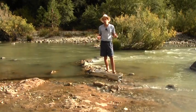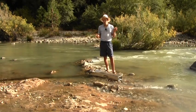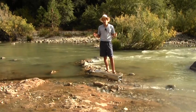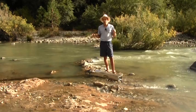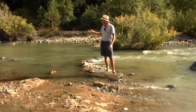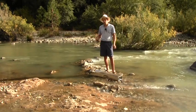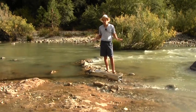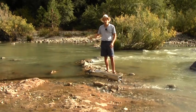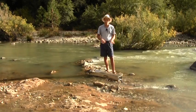The tricky thing about setting up a sluice is getting the angle right. The reason the angle is not just always one number — like four inches for a four-foot sluice — is because sometimes the river is flowing faster than others, and therefore the faster the river flows, the less slope you need. Right now we just had a rain last night, and so we're having a pretty good flow through this river today. On other days when it's really slow, you're going to have a lot less push through the sluice, and that lack of push means your gold and dirt aren't circulating as much, so it's not going to settle out as well.